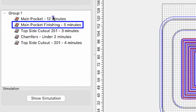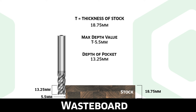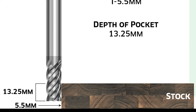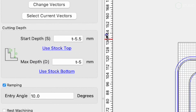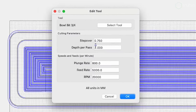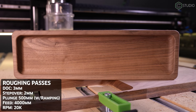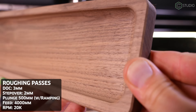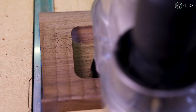In version 3, I created a finishing pass using the value of T and a modifier inside Carbide Create's expression editor. I initially had a value of T minus 5.5 millimeters, meaning it would leave 5.5 millimeters of material between the bottom of the cut and the bottom of the stock. I then set up a finishing toolpath to cut from T minus 5.5 millimeters to T minus 5 millimeters, creating that 0.5 millimeter finishing pass, with a 0.75 millimeter stepover. There are virtually no tool marks — it is straight out of the machine and looks nearly flawless. You could go even smaller — 0.5 or 0.25 — to see how clean you can really get those cross-cuts.